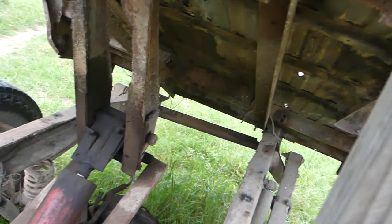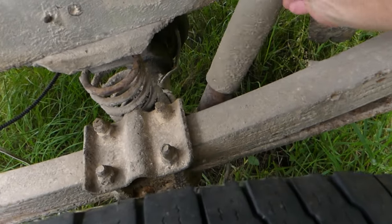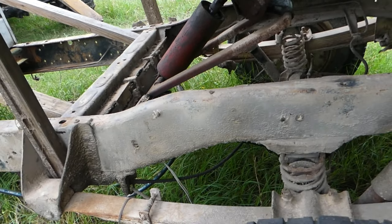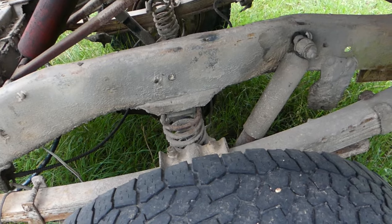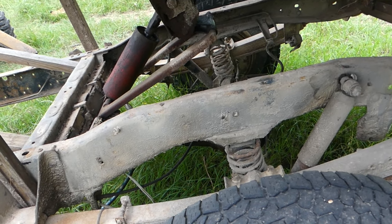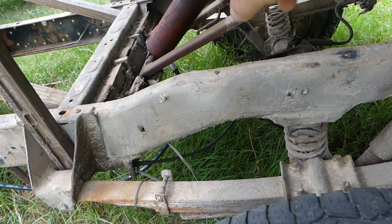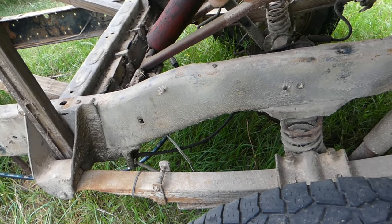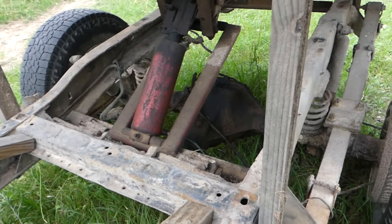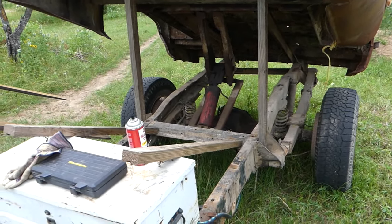There's no plate in there, but that angle iron is still good solid angle iron. How about these shocks? This dirt's gonna get the best ride possible — shocks got some life left in them. I put it up on the internet and nobody replied, but I think it's a scissor kit from the 70s and this dump trailer has seen some stuff. The ram was all worn out. I tried to find some numbers to look it up — I need the stroke. I think I'm going to put in something that'll do 3,000 pounds or more, and try to match the same capacity ram and same size piston. I don't know if it's two-stage or single-stage.